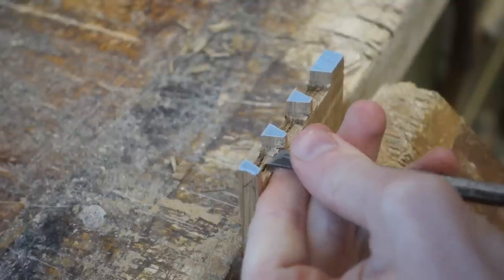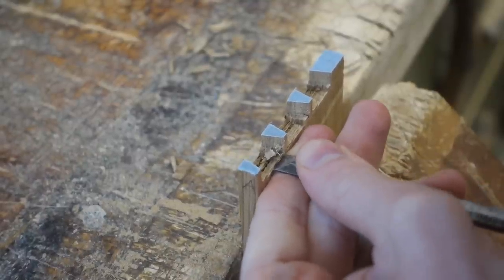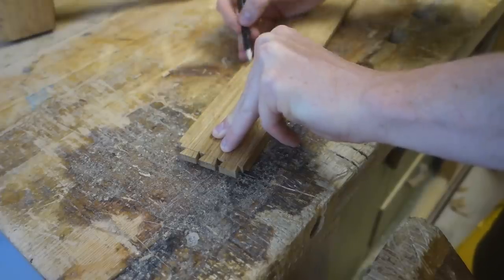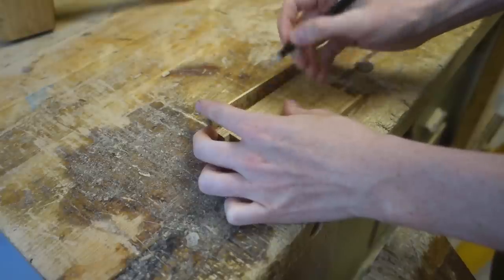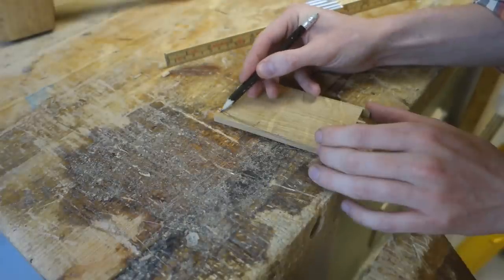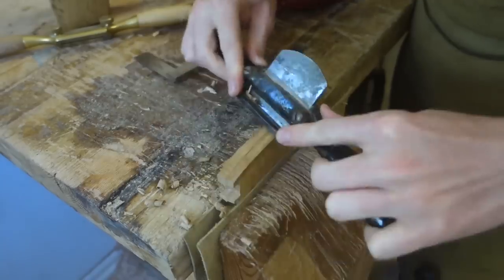That extra large half pin is in this case to allow the top of the pin boards to be shaped into an arch, so the pin will look proportional in the end. Speaking of which, I then marked where the curve should end, and the center, and connected the points with an arch. Chiseled, rough it out, and spoke shaves to refine.